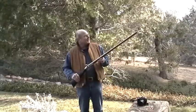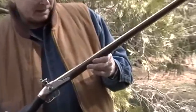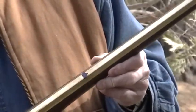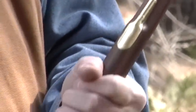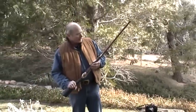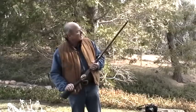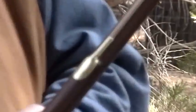The front and rear sights are made by a folding technique that was used frequently in that time period. The pipes were fabricated from flat sheet brass, and the wedding bands — I made a punch to reproduce the wedding bands — are thin, thick, thin.